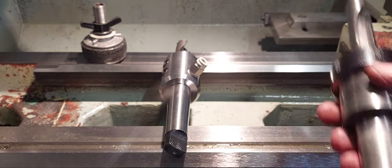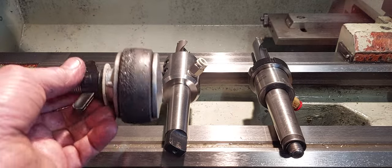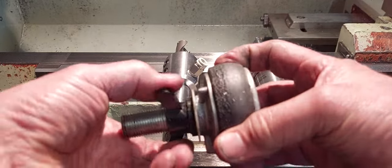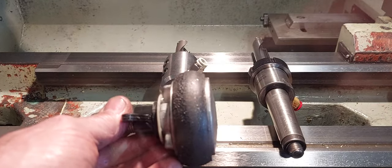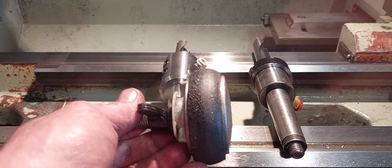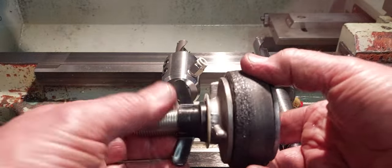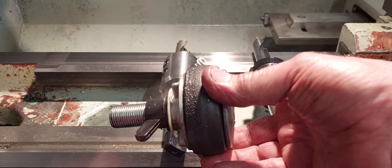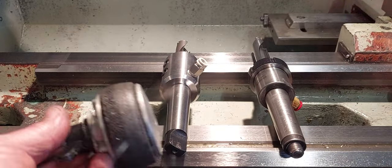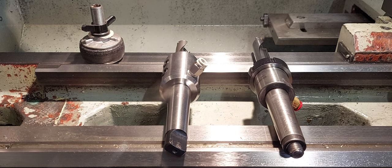For the lathe setup, you'll need some sort of plug for the hollow bore. I use a purge plug from stainless steel pipework - it's a three inch or 75mm plug that swells up when you wind it to block the end of the hollow bore on the lathe. When you break through with the u-drill, the coolant will flush down the bore and find its way to the end. You don't have to block the end, but you'll definitely need something there or you'll be standing in coolant.